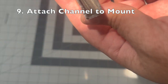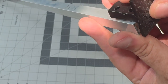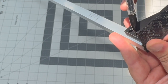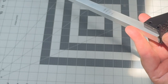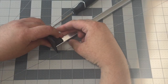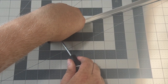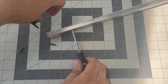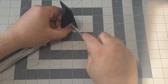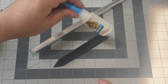The next step is to attach the aluminum channel to the guide rail mount 3D printed part. The best way to go about doing this is to mark the placement of the holes on the aluminum channel, drill those holes, and then verify that they fit onto the 3D printed part. Now we can attach the aluminum channel to the 3D printed part using two 3/4 inch long number 6-32 bolts and hex nuts. Then we can attach the guide rail tip to the other end of that aluminum channel using some super glue.